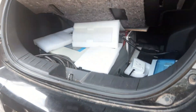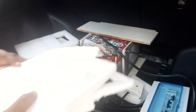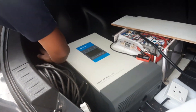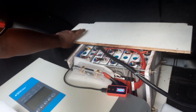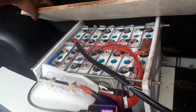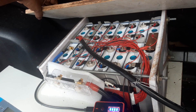What we have here is, you already know this. We have this 5KW inverter. It is PPA. I will turn the battery on. This battery is 16 cells in series, lithium iron phosphate battery, and 105 ampere hour each cell. So this is 105 ampere hour, 48 volt — nearly 5 kilowatt hour battery. Now I have turned it on.